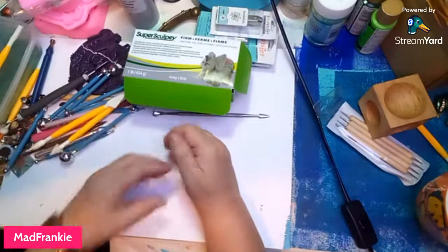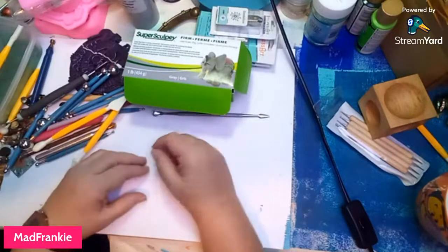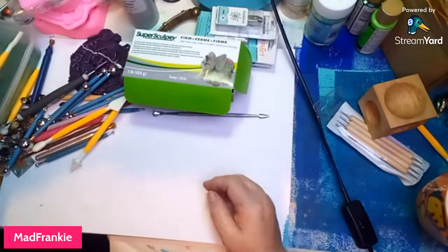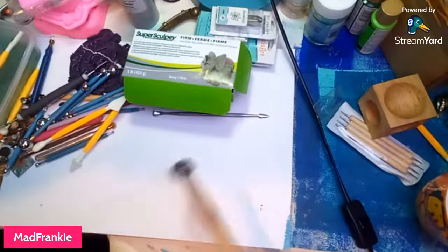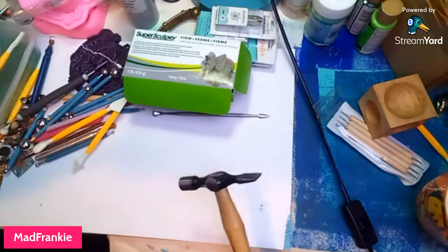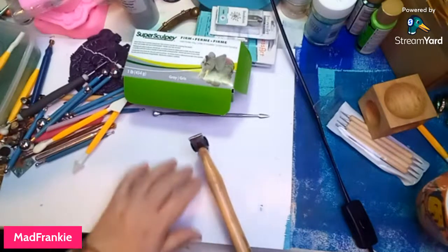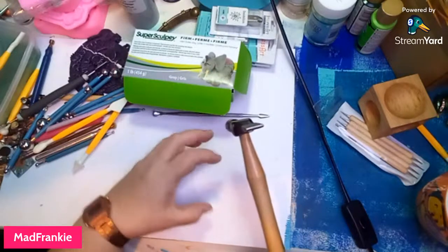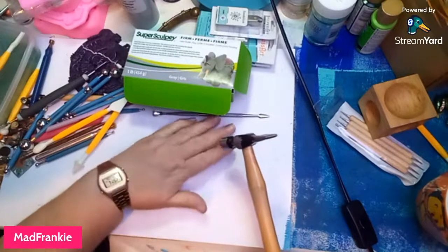It's much nicer. I can go look up anneal, but what is your description of heating it? For what purpose? Because when you are hammering something in copper like that, you are work hardening the copper. Where you smash it, you misalign the atoms of the copper and it becomes brittle and hard. When you heat it, the atoms all line up again and straighten out.